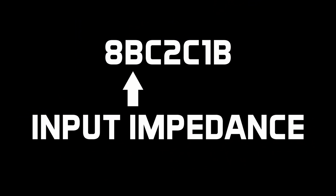The second digit of the model number denotes the input impedance, and that's the important one for DIY and is a letter. For use with a headphone amp, we ideally want a model B or C, which will give us an input impedance of between 150 and 240 ohms depending on the type and size of tank. So for a 4-spring classic as found in Hammonds and Fender Twins the world over that you can drive with a headphone amp, you want the first digit of the model number to be 4 for the type and the second digit to be B or C.